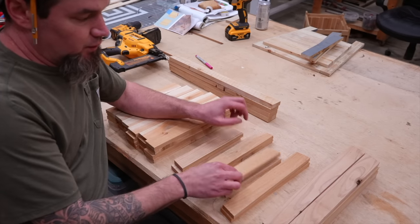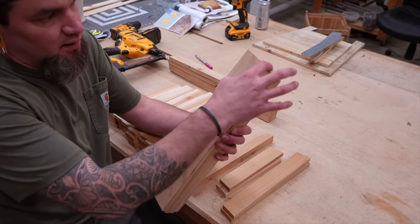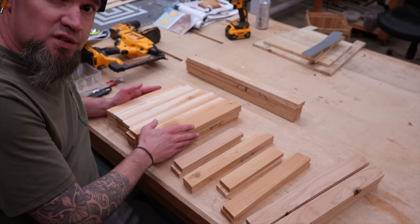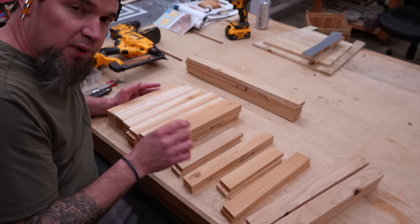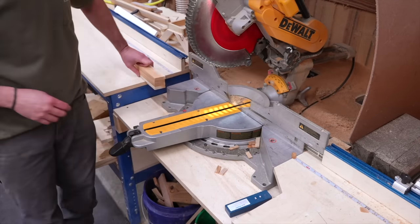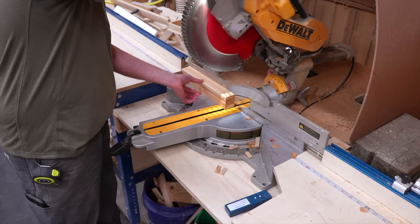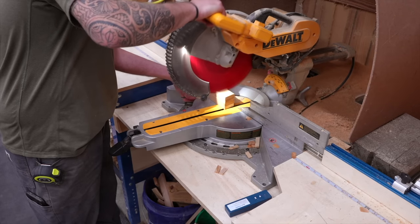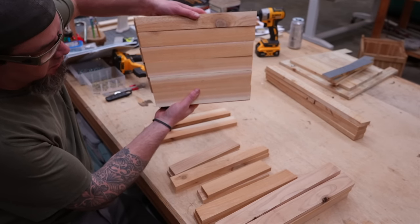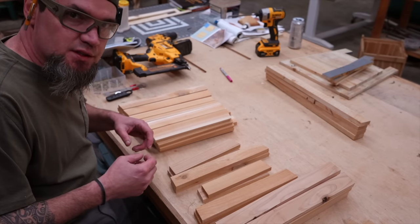All the cross boards have angles facing into each other, and all the legs have angles facing away from each other. These four boards I'm setting aside for the trim on the end, and all the remaining boards will go together to make up my plates for each panel. The plates are cut square, so let's add the eight degrees to each end. For the slats on the plates, we want the angles facing in — put eight degrees on one end, flip the board over keeping the same edge against the fence, and put eight degrees on the opposite end. Now you can see how the plates are going to look.